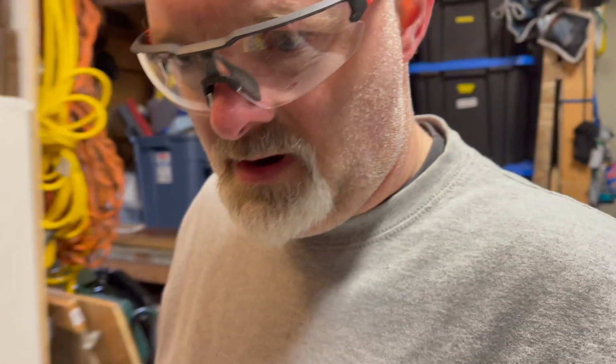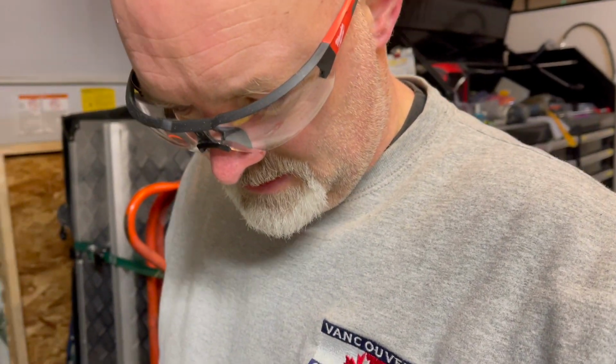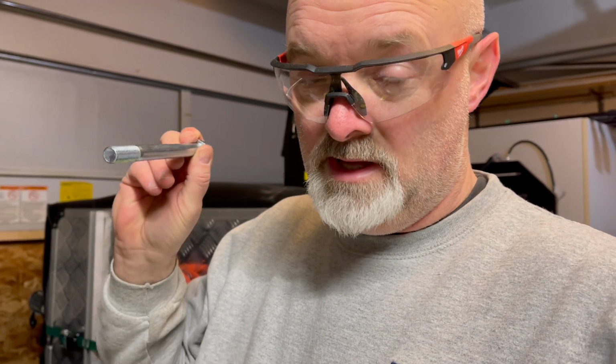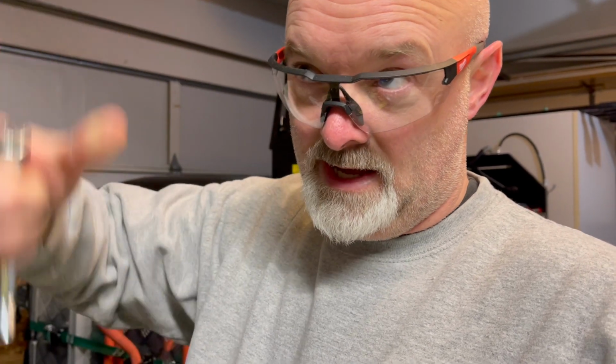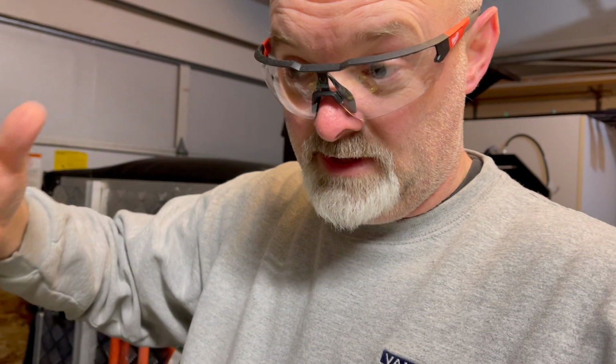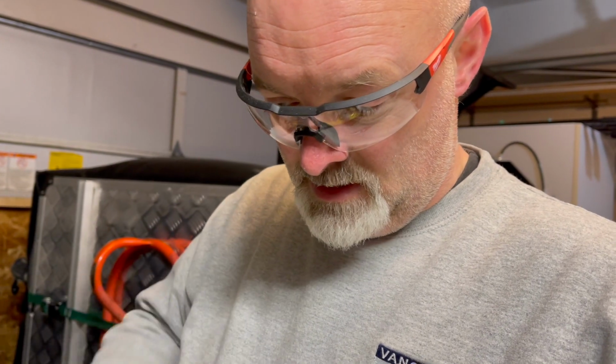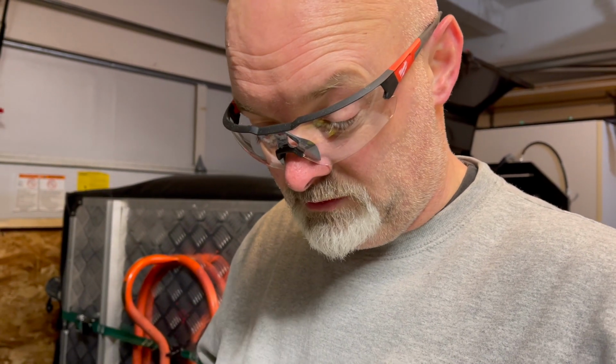So we are lag bolted in. That's all done. Now, I did pick up some carriage bolts, and these are to go through the top plate and into the hanging support brackets or support pieces, just to provide a little bit of extra support rather than using regular screws.